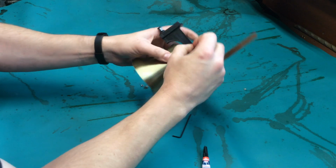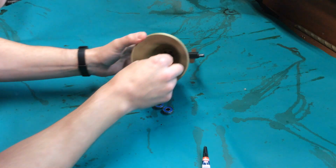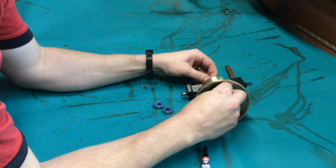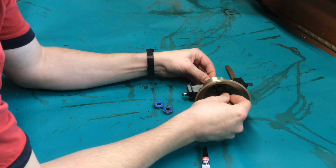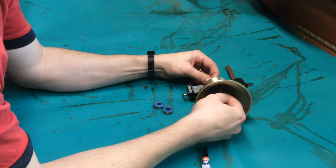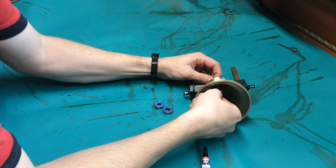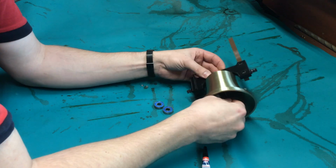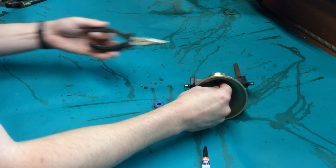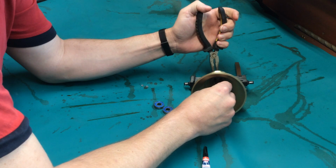And then with each of these, you can just pop the nut over the top of the end of the bolt and use the Allen key on the inside just to wind the nut down onto the bolt, thus against the headstock. You might find that a pair of pliers might help to hold the nut still as you're winding it down.